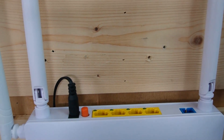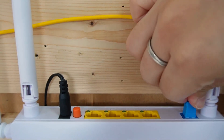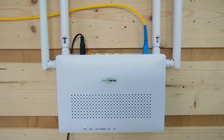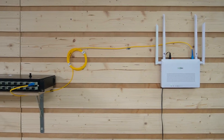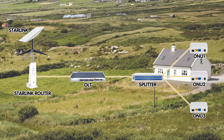Here's the fiber optic cable — let's plug it into the PON port and turn it on so we can get internet access. It's that simple. You've now set up a Passive Optical Network that can serve multiple homes with high-speed internet. Now, what if you live in a remote area? You can use Starlink to beam internet to a central hub, then use PON to distribute it to multiple homes. This can be a game changer for rural communities, but be sure to check Starlink's policies before setting up any PON splitters with their service.